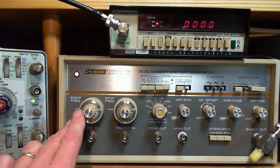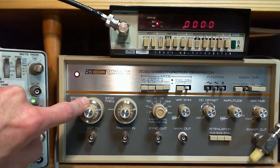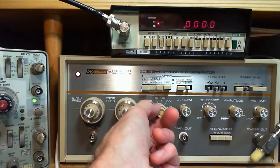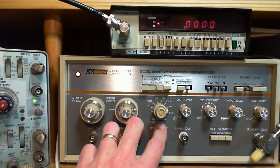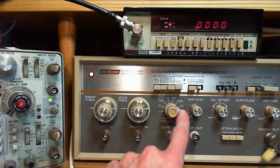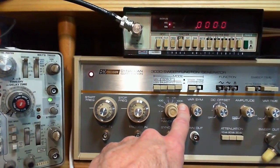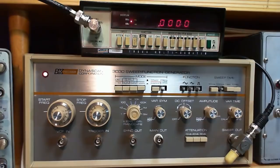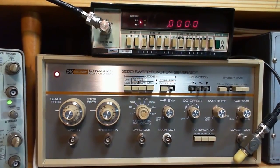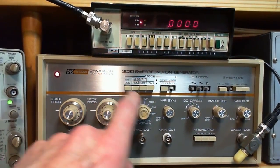But you don't normally have this on S. You normally have it on 0.1, 0.2, see, all the way up to 1. 1 what? 1 times this setting. So this is the range setting. This is here, range in hertz. The little knob inside is start level. So I'll explain start level a little bit later. Right now, it's just this, range in hertz. Up to 1 megahertz. Up to 5 megahertz. Up to 100K. So if you want this thing to work in a radio IF of 455 kilohertz, then you got to have this guy set at least to here. It's going to go up as high as 1 megahertz. Not necessarily. If you set the stop frequency lower, it will stop lower.